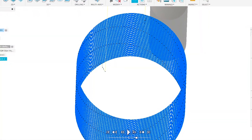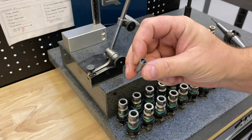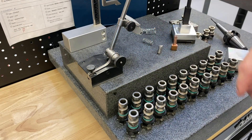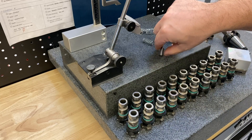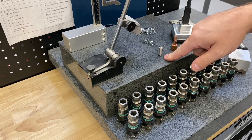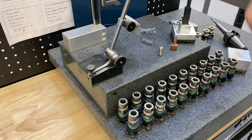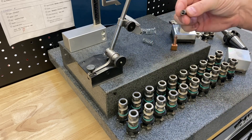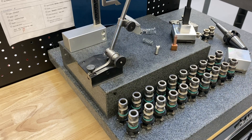The downside to using the bore cycle is that when it gets to the bottom of the hole it leads out back towards the center of the hole. Obviously if you're going around the drill bit and slotting around it, you can't retract inward or you're going to crash. What I did was watch the display on the machine, and when I got to — I think it was about an inch 790 — about 10 thousandths before the final pass, I did a feed hold, stopped the machine, and retracted Z up before it began its lead-out. I was able to get a screwdriver down in there, wedge it loose, and on to the next operation.